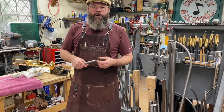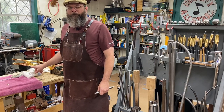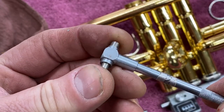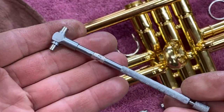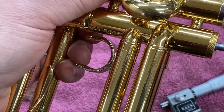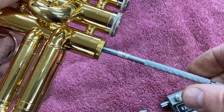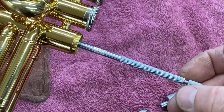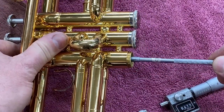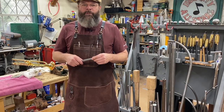The other thing you can do is take an inside measurement with an inside gauge. What you're going to do is pull the springs back, put this tool inside, rotate it around until it's comfortable, lock it, pull it out, and then use your micrometer on those points — and that will give you the size that you need.